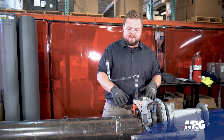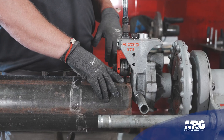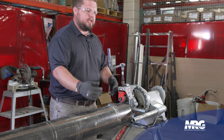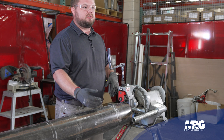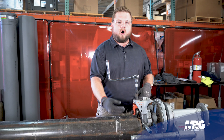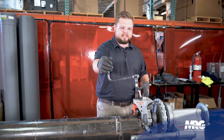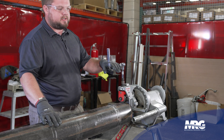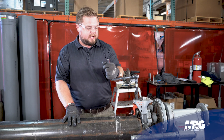Now that I've got everything set up, I'm going to jog the machine and make sure that my groove does not actually walk away from the pipe. Once that's started, I'll continue to groove the pipe. The recommended rotation — you want to see at least two to three revolutions so that you can apply even pressure all the way around the pipe. I'm going to step back to my step pedal and jog the pipe. It's going to kick a little bit — six inches of seamed pipe — so it's going to have a little bit more rotation. Here we go.